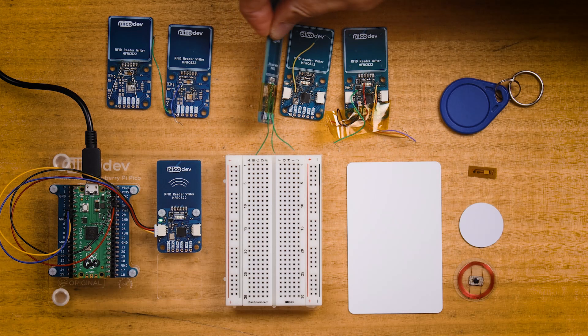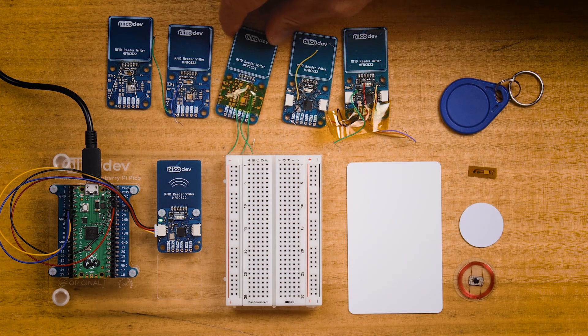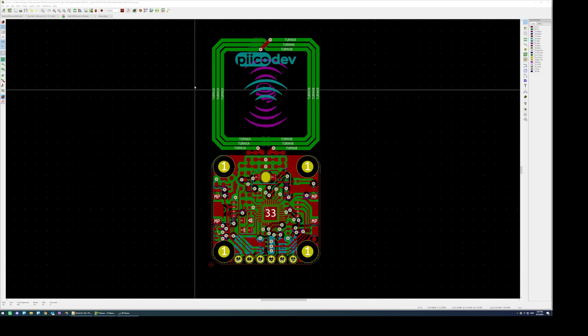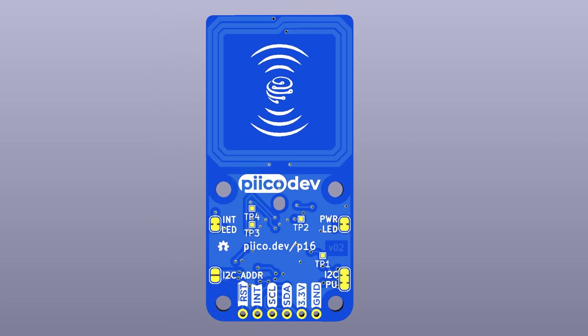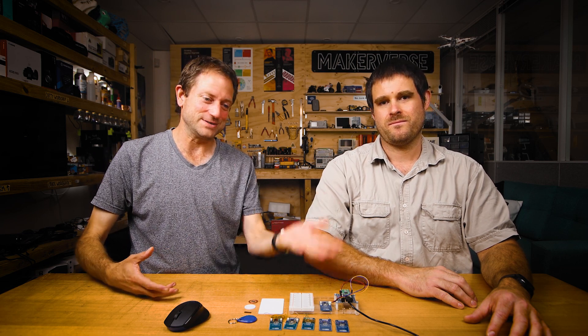So, first revision — had a crack at it, didn't really work. What did you change? The first thing was we've got to get this resistance down, so let's make the coil shorter. We took out 50% of the coil by just putting it on one side of the board. The other thing we did is double the trace width — or maybe more than double — just make it bigger, get rid of those copper losses. We did those two things, then had to redo all the calculations again. We measured the new inductor using the oscilloscope-resistor phase method, did more maths to get the new capacitor values, plonked them on the board — and then it worked. It just worked. We got lucky. Get those values right and suddenly it just rings to life. Got to love reading the manual.